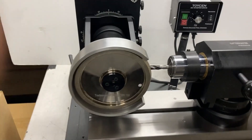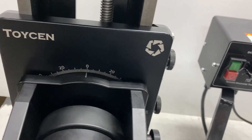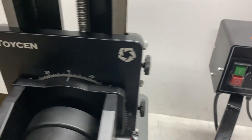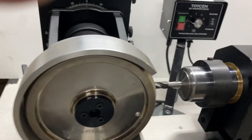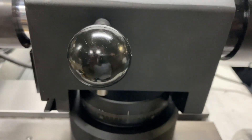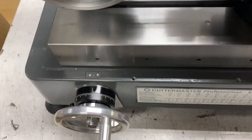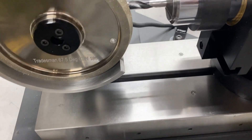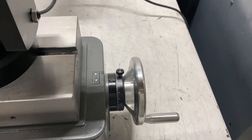This is a plated bond wheel. We have a lot of settings on the new Journeyman tower, so we have the wheel set to level — that's pretty much on zero, there's a scale down there. That's centered and the spindle is straight. To grind the pilot diameter, you infeed with the Y-axis. There are little arrows there to help remind you which way to go. The length of the step is determined by infeeding on the X-axis.